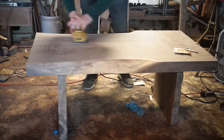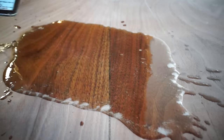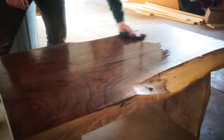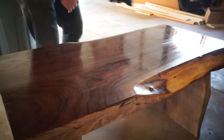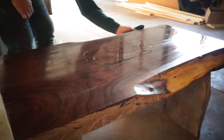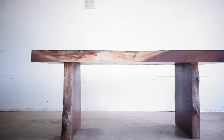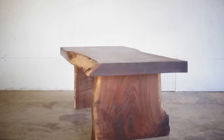After I had the bottom sanded, I flipped it over and finish sanded the top the same way I did the legs. The finish I decided to go with is a natural Danish oil. Danish oil is cool because unlike a polyurethane that sits on top of the wood, it actually soaks into the wood and then hardens, so whenever you touch the table you'll be feeling the wood and not the finish. Once the finish was dry, I was done. I really like the way this table turned out — I love how there's half live edge while the corners are still squared off, which adds a modern edge to what would have been a rustic table.